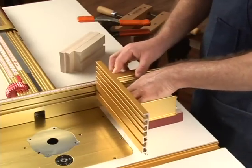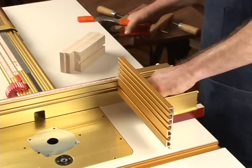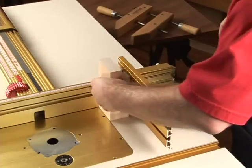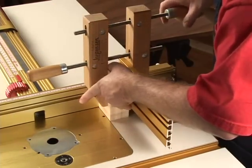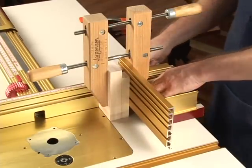When clamping material to your right angle fixture, always tighten the center thumb screw to lock the fixture to your fence. If your router table design permits, a spring clamp can be used to hold the fixture firmly to your table during the clamping process. Use a wooden hand screw to secure your material, making sure the stock is pressed downward and against the fence as you tighten the clamp.